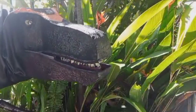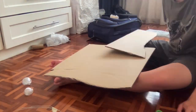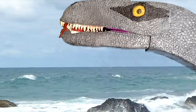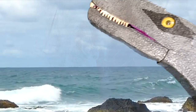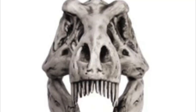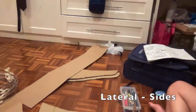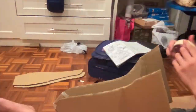I wanted this dinosaur to be as realistic to the true life science as possible, which means blinking eyes and a craning neck, and even some bits about its biology that we've speculated from the fossil record. One problem I've had with previous puppets is that both sides of the face are parallel to each other, so that the lower jaw can align with the upper one when it closes. But since T-Rex famously has forward-facing eyes, I had to bend the lateral faces of the animatronic so that the eye holes are splayed out and face the tip of the snout.